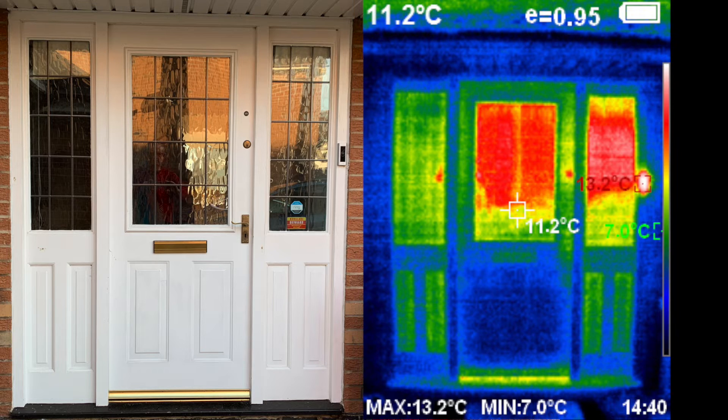For example the doorbell, which is on the right hand side of the doorframe about halfway up, has an illuminated bulb which is always on so it gets hot — and this is the hottest area of this photo at 13.2 degrees C. If you look at the bottom of the door you can see where we're losing heat. It's leaking out under the bottom of the door, represented in yellow and with some green edges. Yellow means more heat whereas green is slightly cooler. The wooden panels either side of the door are losing heat too, showing up as a greeny yellow colour, with a yellow band around the green. There is greater heat loss in the yellow area due to the scalloping moulding design of the centre panel — this is the thinnest part of that panel.